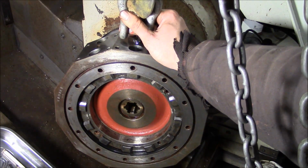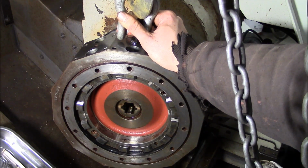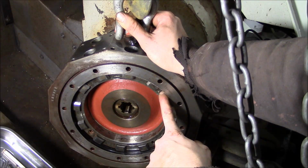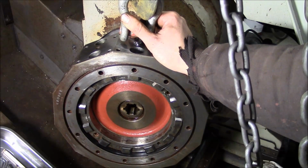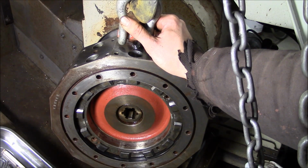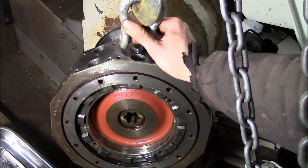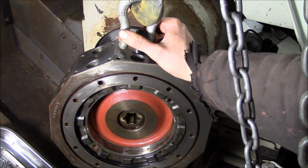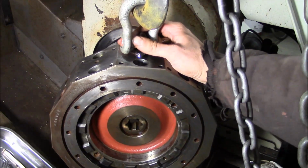Okay, this is the back side of the turret, and there are tapered pins, but Ghosts of Mechanics Past looks like they've been removed. This is a hole here, and there was another hole here. Those would have had taper pins in them originally. There's kind of debate on whether you should put the pins back in. My personal feeling is that once the machine's been crashed once, you might as well take them out. They're not doing anything anyway. The chances that you could put those new tapered pins back in those holes, line the curvic back up to the original spec, and have it actually be right is pretty minimal in my opinion.